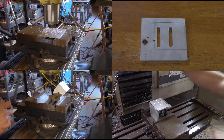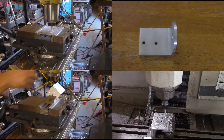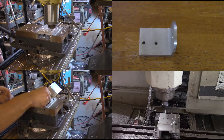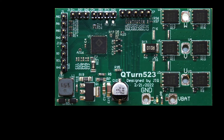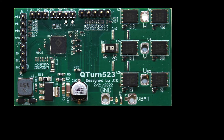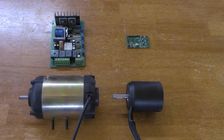In order to mount the motor into this cavity, I'm going to have to machine two parts: the first one is a spacer, and then I'm going to need a right-angle bracket where the motor is going to be mounted. For this design we're going to use the NXP 5523 baseboard called the Q-Turn 523. I've explained in other videos why I like to use the NXP 5523 to drive three-phase BLDC motors, but notice how thanks to its integration we can end up with a solution that is more powerful than the obsolete technology and yet occupies considerably less space.